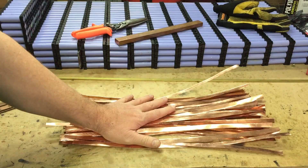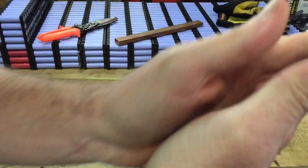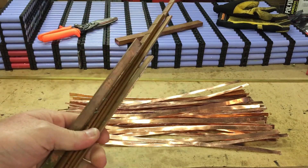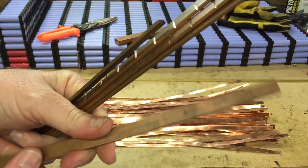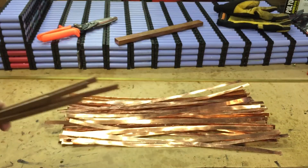The music's done. We've got the copper cut — got a little bit arduous towards the end. I think my tin snips are going blunt; I don't know whether they're sharpenable or whatever. Old hands copped an absolute beating, they're so sore. But we've got enough bus bars done. We've still got to get some of this cut up — this is the old busbar saga — so this will just be cut into 5.5cm strips, with a 7mm hole drilled in it.